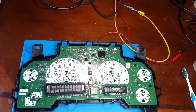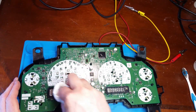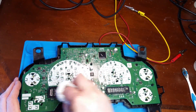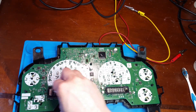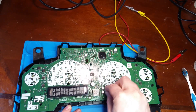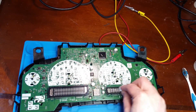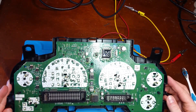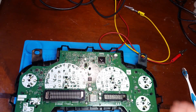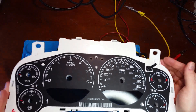If you're watching this video because you have one of these clusters with bad displays: there's about a 25% chance you can get away with just reflowing the MOSFET if the solder joints failed. But if the damage is any further, just send it off to someone that can do it. Otherwise it might end up causing irreversible damage if you go at it too much with the wrong tools and too much heat.